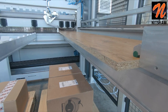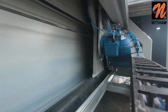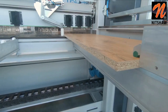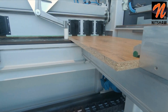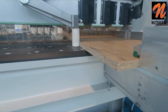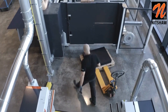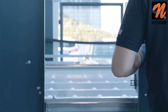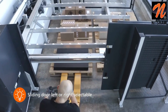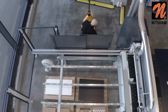Here in the example, you can see how the side pressure is always in working position and presses the work piece against the cross-cut fence. After the work piece has been fixed by the pressure beam, the saw carriage starts immediately and cuts through the work piece. The time-saving results from the fact that the saw blade always waits extended to the saw station for the next cut and the side pressure does not need a new positioning time. The Linear 6015 gives you back valuable work time — a double sliding door opens 1.80 m wide, and more than 6 square meters of storage space are hidden under the rear support rollers.